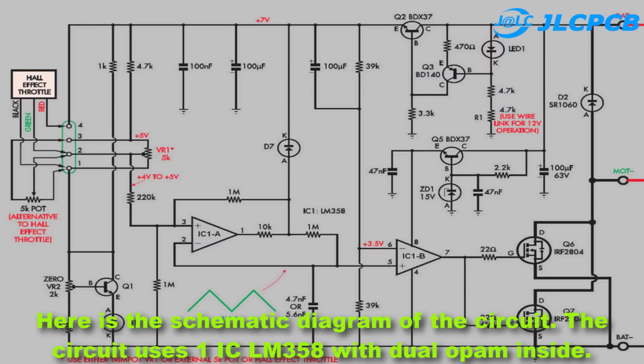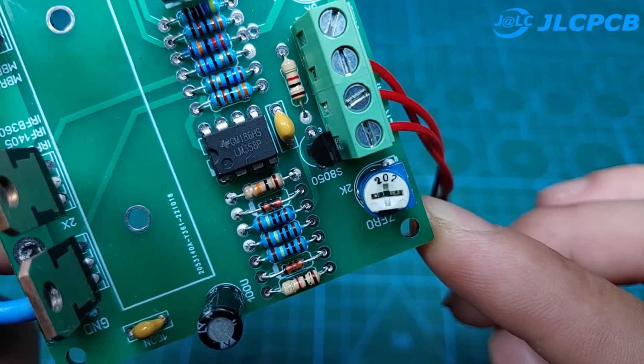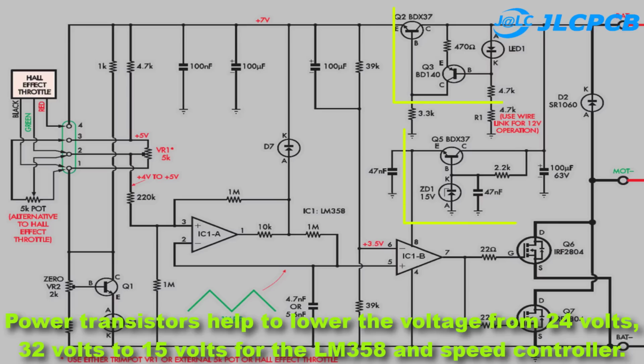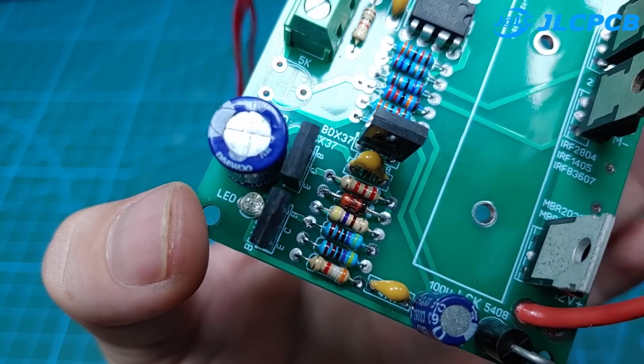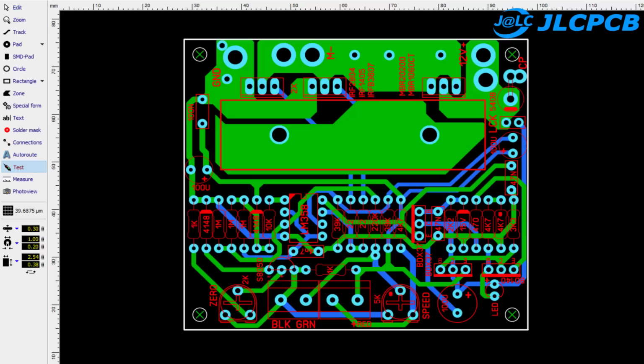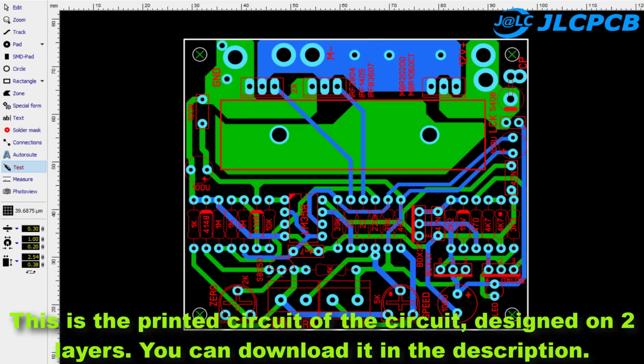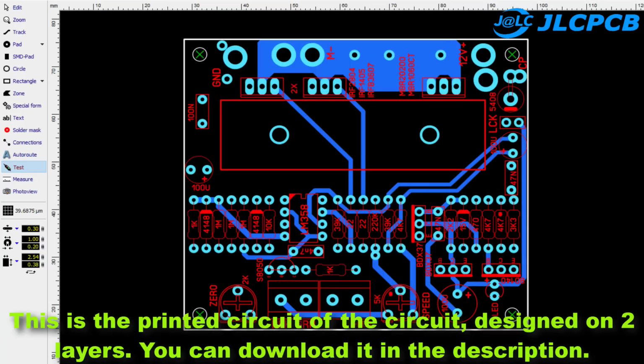Here is the schematic diagram of the circuit. The circuit uses one IC LM358 with dual op-amps inside. Power transistors help to lower the voltage from 24 volts or 32 volts to 15 volts for the LM358 and speed controller. This is the printed circuit of the circuit, designed on two layers. You can download it in the description.